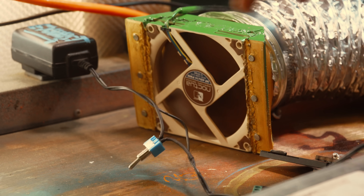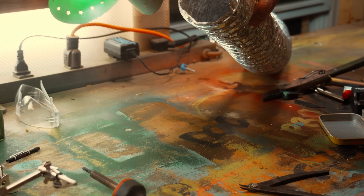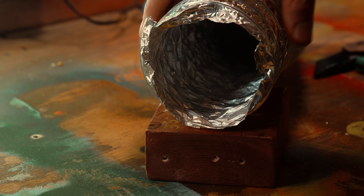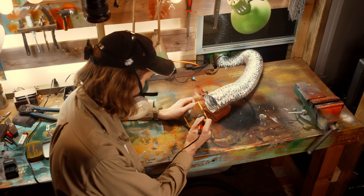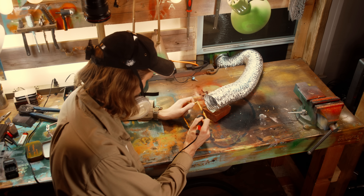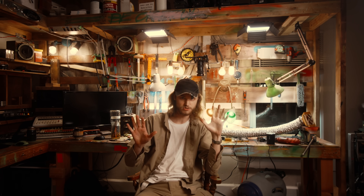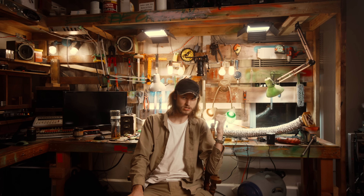At the end of the tube I really don't need anything special — just something to add weight so it actually stays wherever I put it. What better for that than a piece of scrap wood. That's a little pathetic but I can upgrade later. If you build something like this yourself, probably use a bigger fan. When I'm really cooking in here I just open all the windows and stick a box fan in — that does a pretty good job. Part of the use case for this is having an option that doesn't disrupt my audio while I'm recording. If I want some extra juice I can just slap one of the server fans from the injection molder onto it and it'll do way more fume extraction.